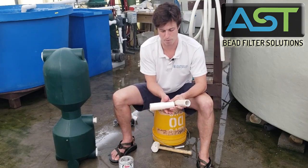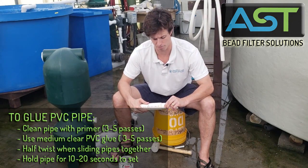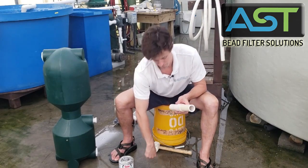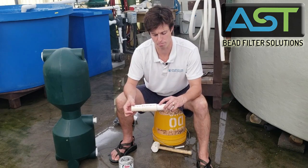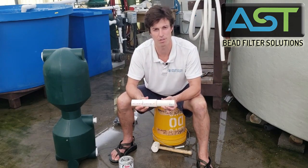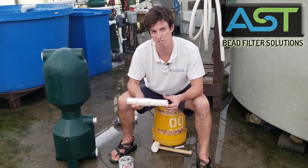When putting these two pipes together, I want to have at least a half twist. I'm going to make sure it bottoms out, then hold it in place — you can always clean up the excess. One thing that does happen is you will get pushback, so after you glue it together the pipes will want to come apart. You need to hold it together for 10 to 15 seconds while that glue sets, to get a real strong bond between the two pipes so it will not fail.